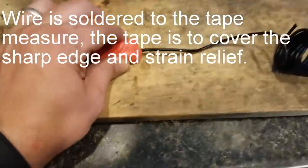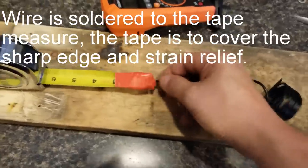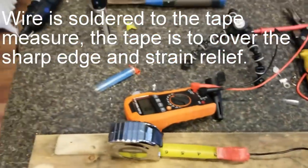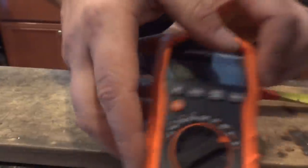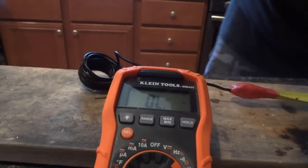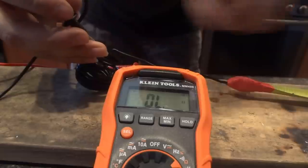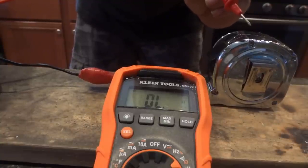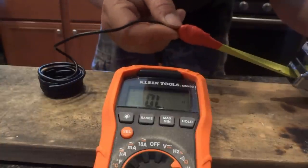While I was off camera, I wrapped the edge because it's kind of sharp — went ahead and wrapped it in tape. This wire is connected to the edge of the tape very well; it's not going to go anywhere. Let me set you down here and show you the continuity test. I've got it set up to let out an audible tone. We can go ahead and stick the probe into this side, and just go to the body of the tape measure, being as it's metal. You can see we've got continuity. Let's trim this wire down and put the ring terminal on and continue on.